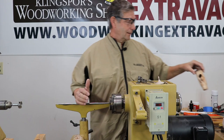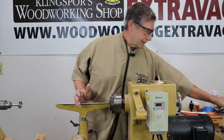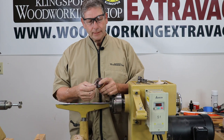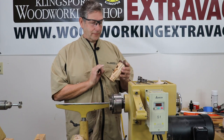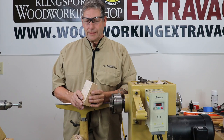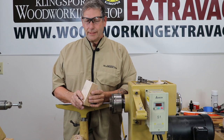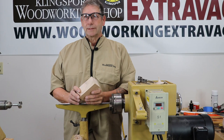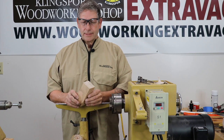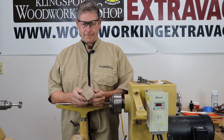It's a great wood turning piece to make because everything is turned — even down to the perch. We make the perch, we make the top. The only things I didn't make are the string and the eyelet. I also learned to do a little bit of wood burning — I'm not a professional wood burner, but Michelle Parsons is and she'll be here later next week. We start with eight-quarter stock, which is two inches thick. I rip these down as square as I can, then go to the drill press.